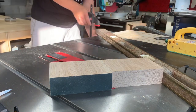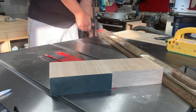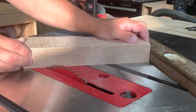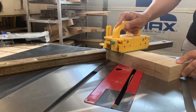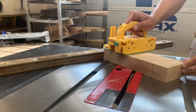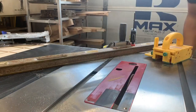The angle will vary based on the depth and width of the cove you're trying to make. Double check, then we'll move the square. We're fitting our marks. You'll want to start with the blade lowered all the way back down. You can only raise by a 32nd to a 16th of an inch with each pass, that way you don't bog down the blade.